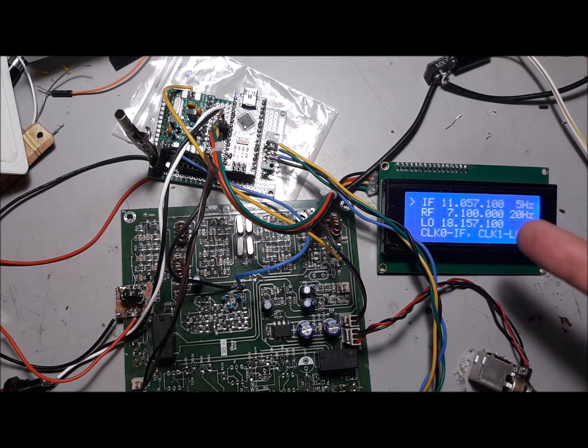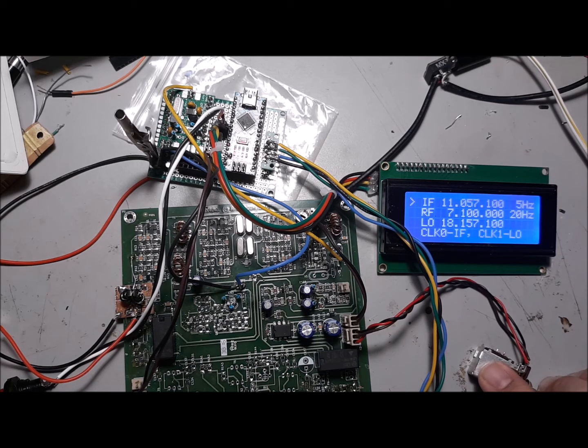And I noticed when I was calibrating, or when I was testing these crystals, they seemed to be low, and I just thought it was maybe due to capacitance or whatever, but they are in fact low by about 1 kilohertz. Interestingly enough, don't care, it works. In fact, you can hear it. It's working fine. Sideband rejection could probably be a little bit better.